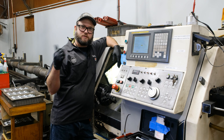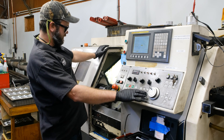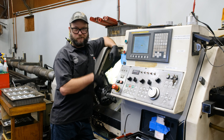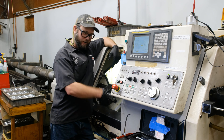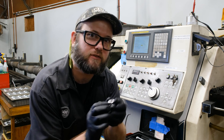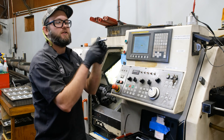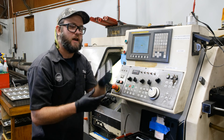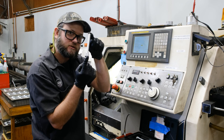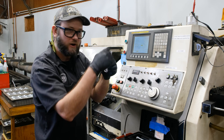You can basically take full 12-foot bars, stick them in, and this thing will chop it up and catch the parts. It's got a little parts catcher in there. It'll make a part, cut it off, advance the bar, make a part, cut it off, advance the bar — catching them in a little conveyor that comes out into a bucket. So we make all our round things like axle nuts, the axle, and then you assemble the nut onto the axle. Motolite arms come off the lathe first, then go onto a mill to get all the milled features — all the square stuff.